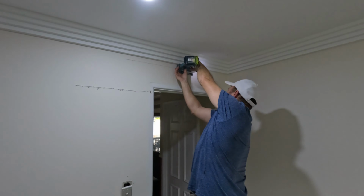If you haven't used one of these tools before, I've said it so many times, I've done so many videos on these. This is my favorite tool. This wall is 10 mils thick. You've got cables in the wall, you've got timber, everything like that. I set it at like 9 mil. So it just cuts it, and you can actually put a vacuum attachment on as well. To get it going, you just hold it like this and then plunge in and then start going. It is a good idea to always use it with a vacuum because you don't want dust to build up in there.